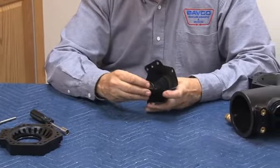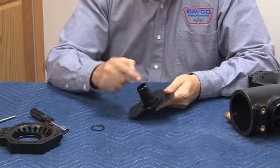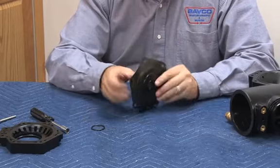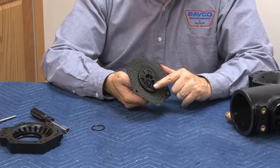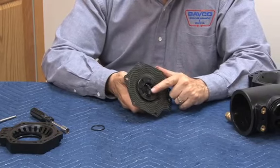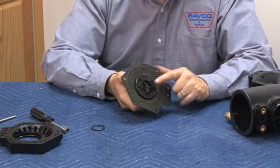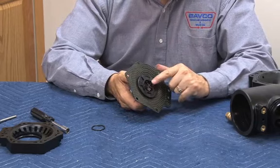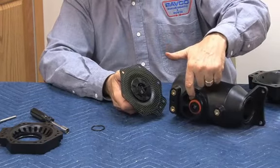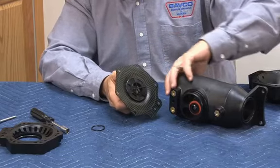There's going to be a stem O-ring. The upper stem is called a plunger, then our relief valve diaphragm, and this is our relief valve seat right here. There's this piece of spring guide which sits in the middle, which gives us a little protection so we don't hit the face of the seat, but this is something you want to be aware of. That is your relief valve seat right here. We mentioned earlier that the relief valve disc stays stationary while the seat moves in and out.